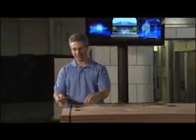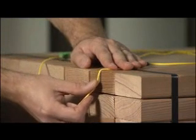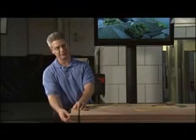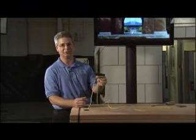I'm going to take this drop cable and put it across a hard 90-degree bend. With a single 90-degree bend in that drop cable, there's a very significant impact to the loss and you can see degradation in the video quality. With 15 to 40 of these bends, it's bad news for the subscriber and a big challenge to solve.